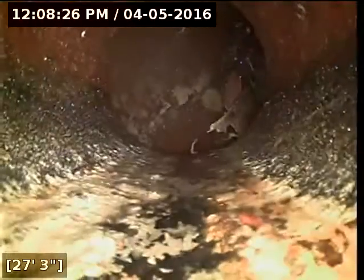We're right up close to the fence on the right side of the property. The line runs, again, up the right side of the driveway if you're looking at the house from the street. And then about halfway up it crosses over underneath the concrete driveway. And we're at 3 feet deep there at 28 feet. And that white T marking is a couple feet in on the front side of the fence.